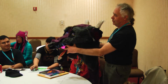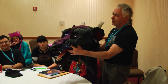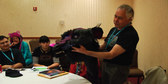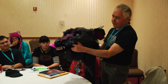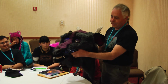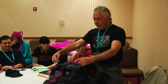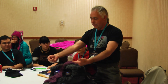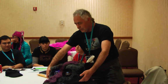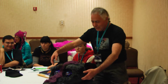You can see the eyebrows as they move. Oh, wow. Yeah. So that works with his mouth. His mouth has a little position sensor so that if he opens his mouth, then his ears go back and his eyebrows go up. For the retrofitting of the eyebrows, I have 2 aluminum pieces that go up in a semicircle and then 2 linkages that go down the side. And I had to install 2 servos down here under the cheeks. That was a bit of doing, right?